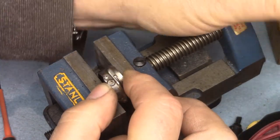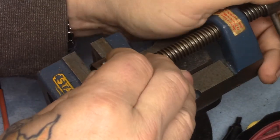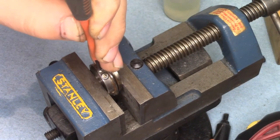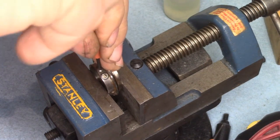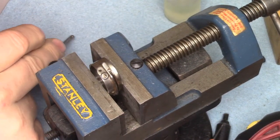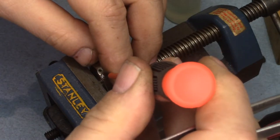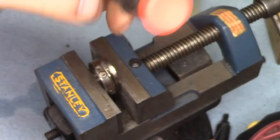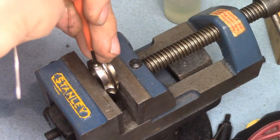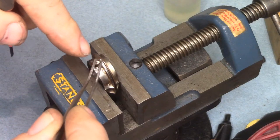I'm going to hold it in my little machinist vise — it's on a stand, not really tight, just holding it in basic position. I'm going to take this apart, starting with this little tiny screw up top, and I'm going to grab the screw as it comes out with a pair of tweezers and set it off to the side. Then I'm going to loosen up the adjusting screw and take it out as well. This does mean it will have to be readjusted after cleaning and reassembly.